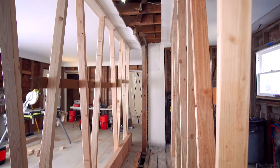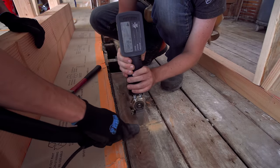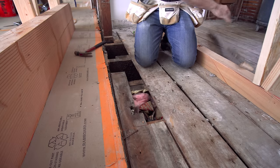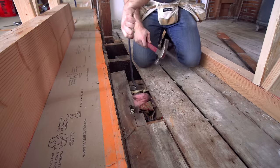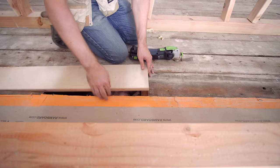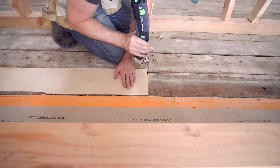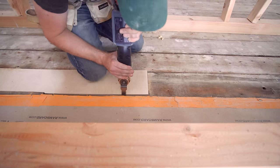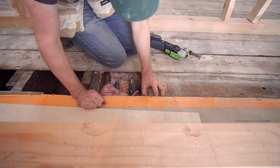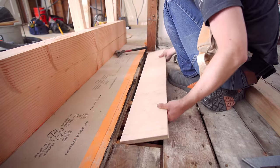The old wall has now been removed, but there's a lot to do to rebuild. The floor was in pretty rough shape because it had a floor vent in the middle of it as well as electrical drilled out. I ultimately decided to remove some of the sub-flooring and patch it with plywood. When it comes to making an exact patch in drywall or a subfloor, I find it's easier to cut the floor to match the patch than the patch to match the floor. These oscillating multi-tools are great for this — you can trace around a patch that's slightly larger than you need and sneak up on a perfect fit.